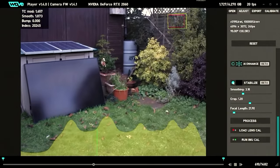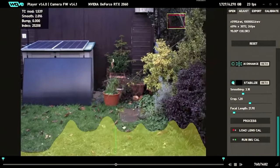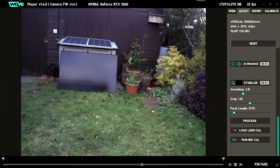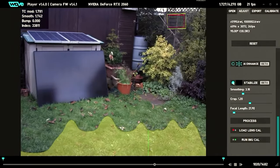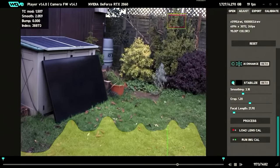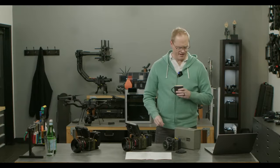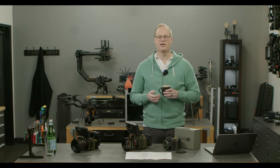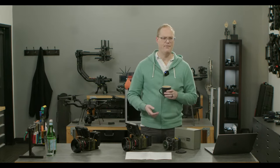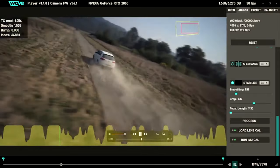There's a really nice IMU in Ember, so it's keeping track of rates, pitch, roll, yaw rates, angles, and accelerations. He's integrating that using some fancy maths and figuring out an attitude estimate for the camera. Then he's come up with a thing where you can just input the focal length of the lens and it'll analyze everything and figure out stabilization to apply. You can adjust how smooth you want it to look. One of the things we're known for is organic stabilization on the Movi, and we're trying to bring that same methodology to cameras so it doesn't look too robotic or manufactured.